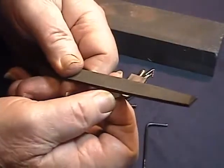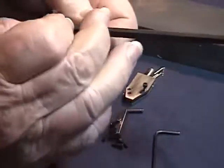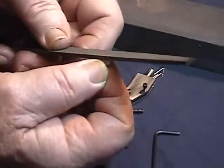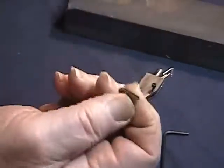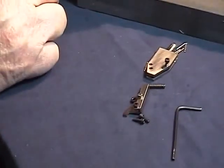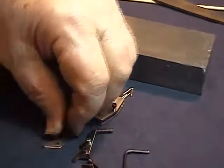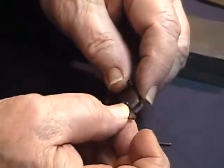To perform the little bit of maintenance that keeps them centered and in shape, I'm using the 90-degree edge of a file. I'm going into the groove — not flat, and not up on the other wall. I just wipe this through and it renews the groove in the shoe. Many times I use a sharpening stone to resurface the shoe. That generally takes care of the maintenance of the collet shoe once or twice a day.